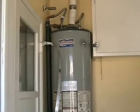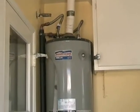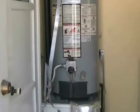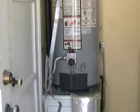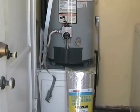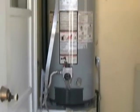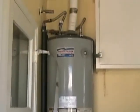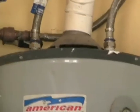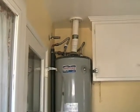It's pretty much a straightforward install, but you should be aware that when you're putting this on a gas water heater — which is what this is — you want to make sure you don't block the bottom portion where the air has to come in for the burner. And you don't want to block the upper portion where the flue is. It's common sense, but it's still something you need to pay attention to.